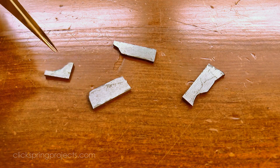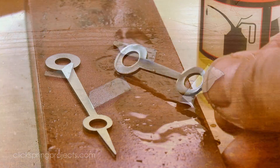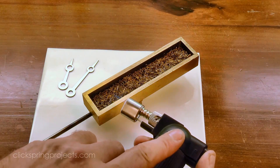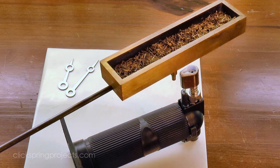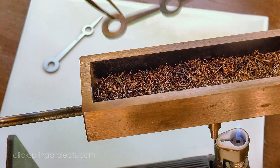You can see it doesn't take much force at all to shatter the work into several pieces. Tempering reduces this brittleness and gives me a little more leeway to handle the parts safely, while at the same time making the steel easier to polish. As it happens, the temperature we want to temper the work to corresponds to the blue oxide colour — a little over 300 degrees Celsius — which is why you see the steel blued twice. Once is for this tempering, and the second time at the very end is just for the appearance.